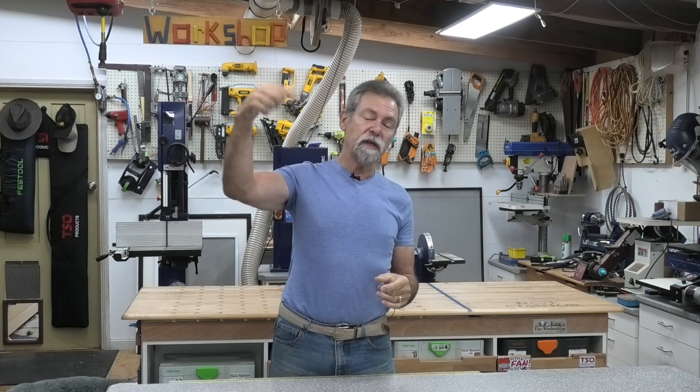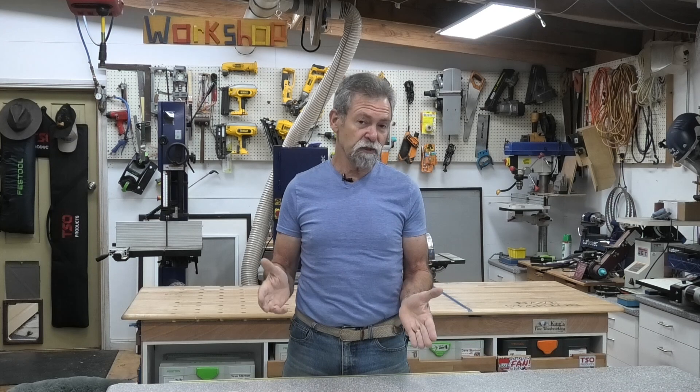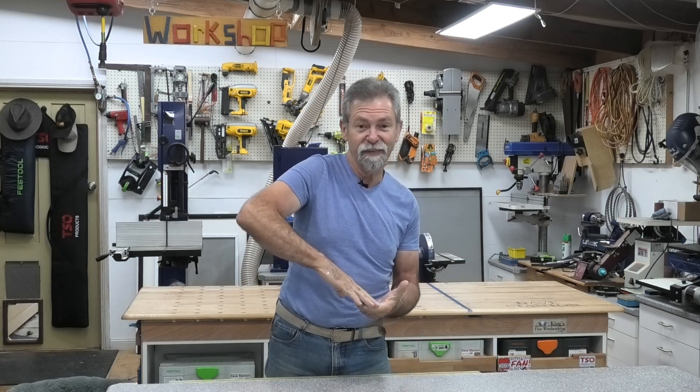Panel placement is a little bit of a science on its own. In the southern hemisphere, to generate the maximum amount of power over the whole day, you aim your panels due north and tilt them above horizontal at your latitude south. In the northern hemisphere, you aim south towards the equator, and tilt at whatever latitude north you are. I'm around 33 to 34 degrees south, basically in line with Sydney. So the majority of my panels perform best at 34 degrees tilting, aiming north.